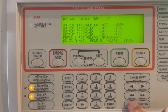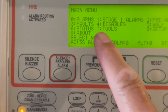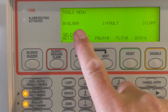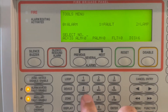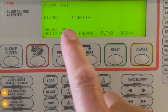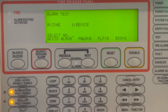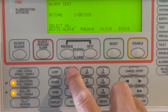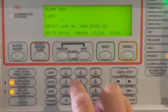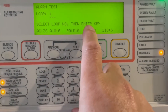To begin, press the menu and then press number seven, which is tool seven. It will ask you for an alarm. You are in the tool menu and you test for alarm. Then it asks what zone or device — zone is for conventional and device is for a specific address. Press one, and it will ask what is the detector address and what loop.